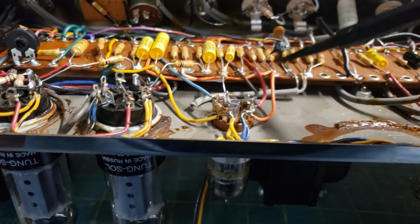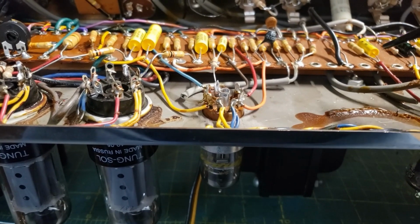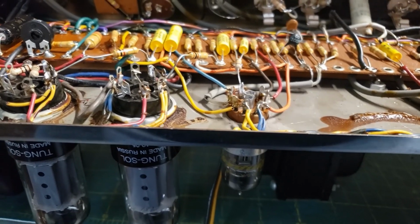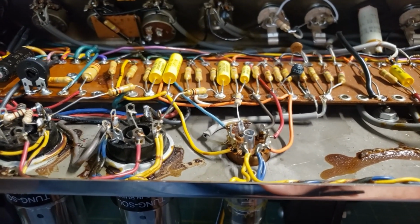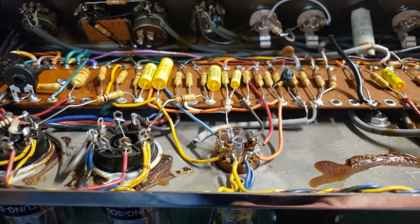There's not a lot of gain in the pentode wiring, and the amp's got tons of gain to spare, and the cathodyne is almost a unity gain circuit, so it really matters if the tube is good and quiet more than anything else there. But we will find out.